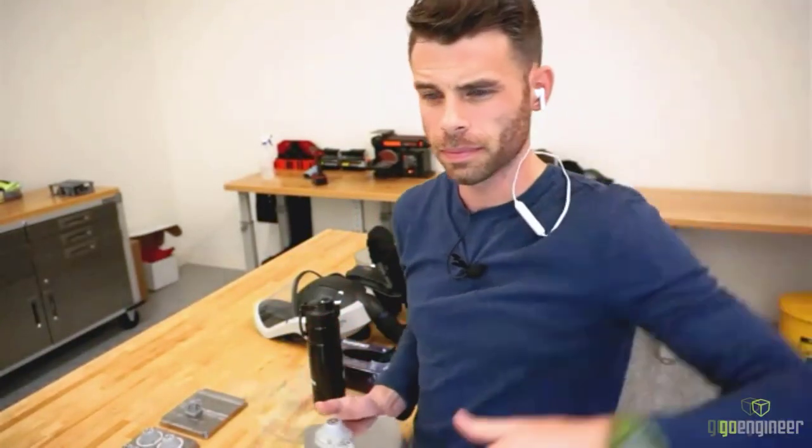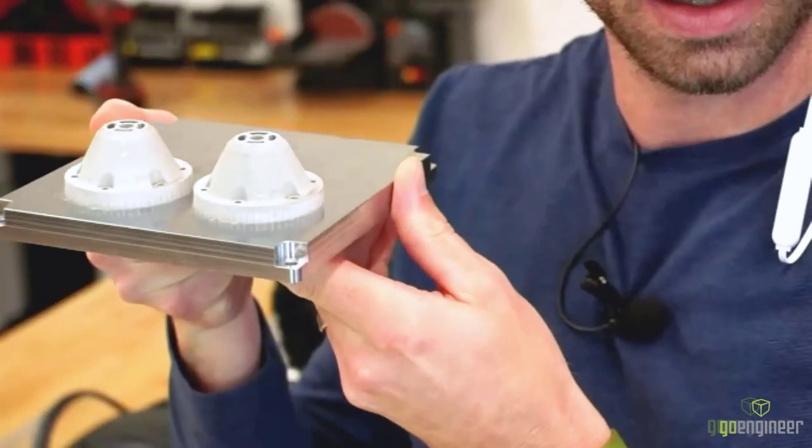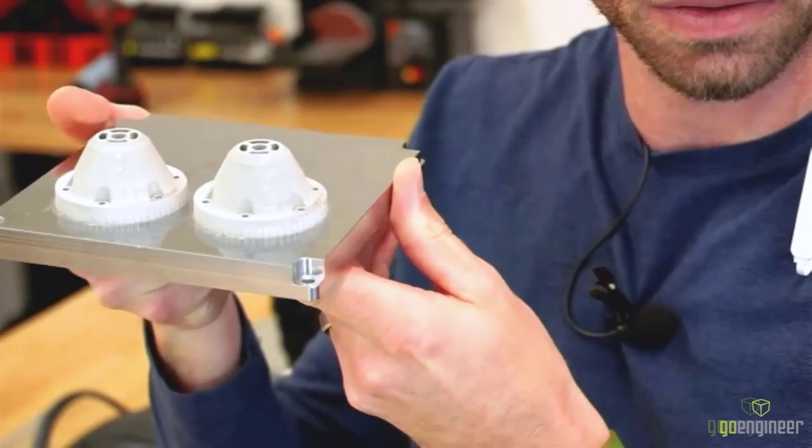There is no sintering of these parts — I get asked that question a lot. There's no shrinkage really to deal with. The parts come out near net shape, plus or minus 0.2%, which is standard for laser sintering accuracy. Parts may have some internal stresses depending on geometry. In the case of these parts, we cut them off the build plate and they're ready to use, perhaps with a little support cleanup. You may notice they're elevated off the build plate — in this case about three millimeters — to give ourselves space to cut them off with a bandsaw.